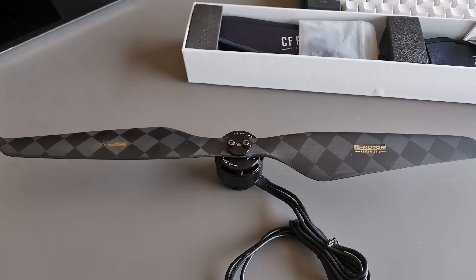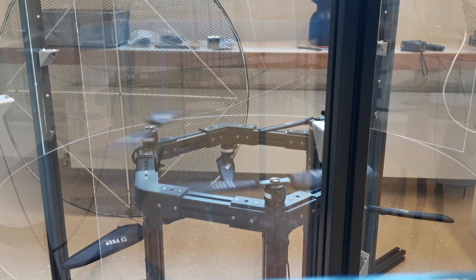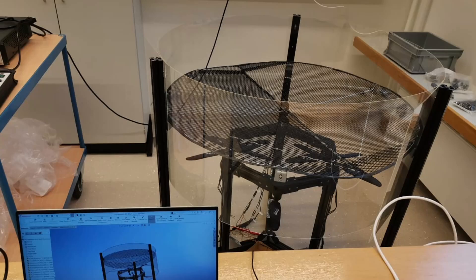The first thing we need is a source of vertical airflow, which will be a wind tunnel. Since buying one is extremely expensive, the only solution was to design and build the wind tunnel myself. The initial design had six brushless motors and six propellers, each with a diameter of 40 cm, symmetrically arranged at the vertices of a regular hexagon. For the frame, I used aluminum profiles and 3D printed parts. The air produced by a spinning propeller is not laminar — it tends to rotate in the same direction as the propeller, creating a vortex. To reduce vortices, three propellers rotate clockwise and the other three counterclockwise. The clockwise spinning propellers are positioned above the counterclockwise ones, creating overlap between their airflow areas. This not only helps reduce vortices, but also ensures the propellers cover a larger area of the wind tunnel. I also used a metal safety grid to prevent anything from falling into the propellers while they are spinning.